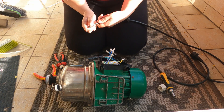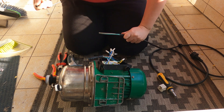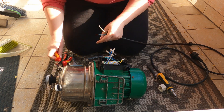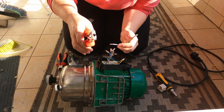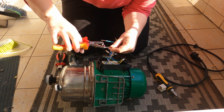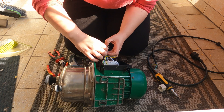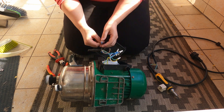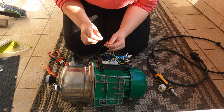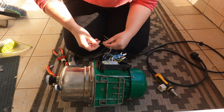First I had to remove the insulation. The big outer insulation I removed just by cutting it with a knife and then pulling it out. For the insulation from the individual wires, I used little insulation clippers that you can adjust to the thickness of the wire inside — you snap and pull out the insulation and it leaves the wires. In order to test the pump, all I did was connect the wires together in the appropriate colors. This is the European version, so our ground is yellow and green.